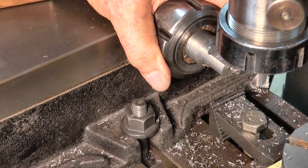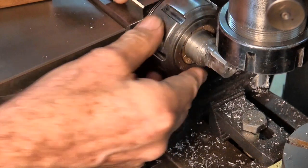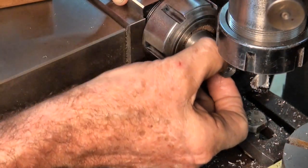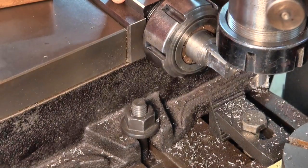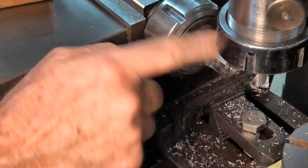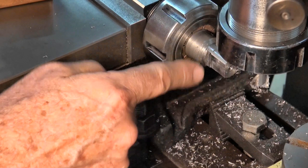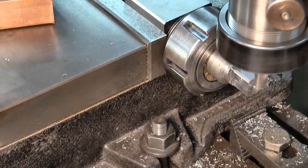So what I need to do next is to cut a quarter inch slot through the center of this stock. It's a fairly deep cut, and this piece doesn't need to be that diameter there. I'm going to reduce this down to the diameter shown for the eye, which is 11/32. So I'll take enough stock off the top and bottom to give me 11/32, which will allow me to get the correct radius on the end of the eye. Then I'll cut the quarter inch slot.